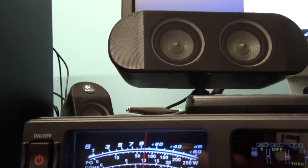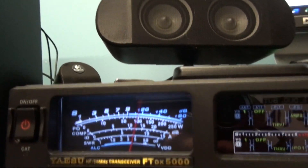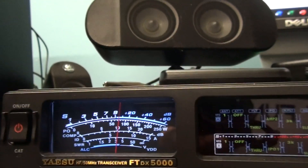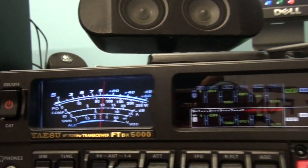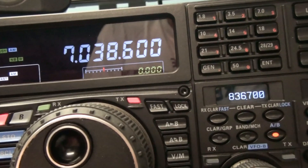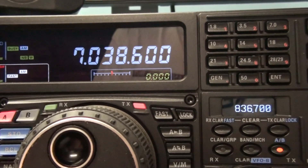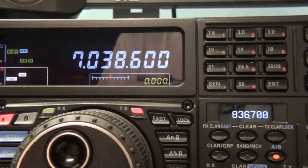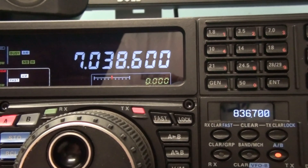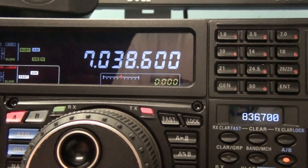It's still got a high noise floor, but it seems to be blocking out all that excess interference noise. It's gone from basically unusable to usable by fitting the choke at the feed point. This aerial is resonant and doesn't need a tuner at 40 metres, 10 metres — I think it covers 80 to 10 or similar. So having to tune it just to block noise was a pain; now it works well without it.